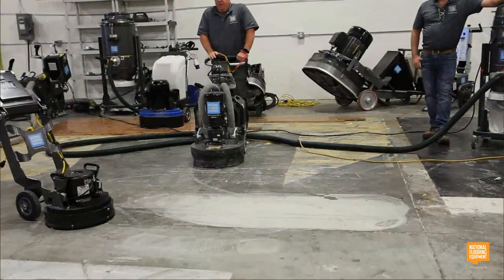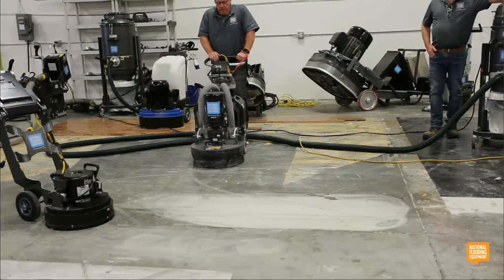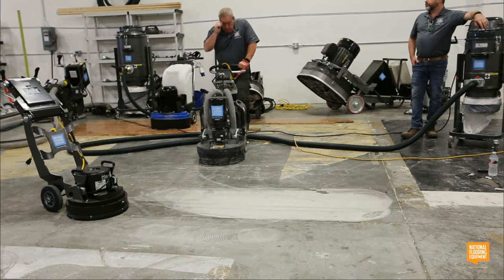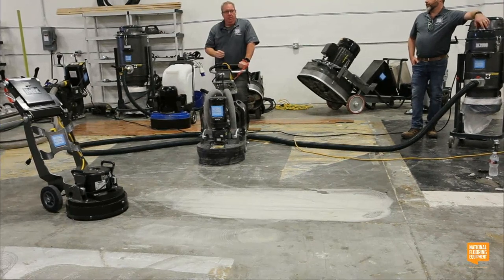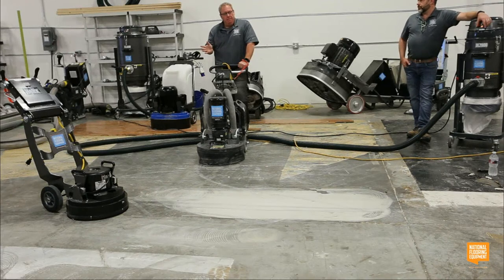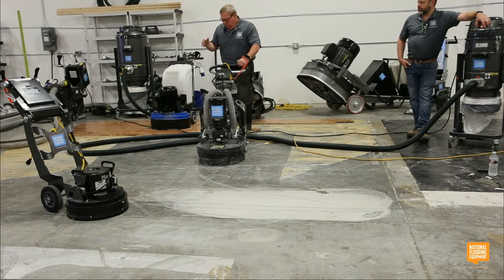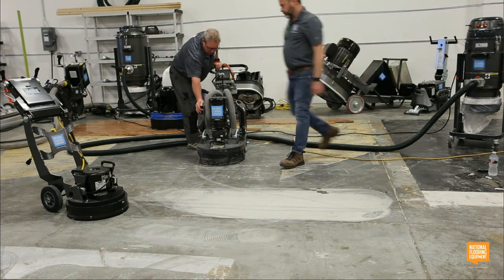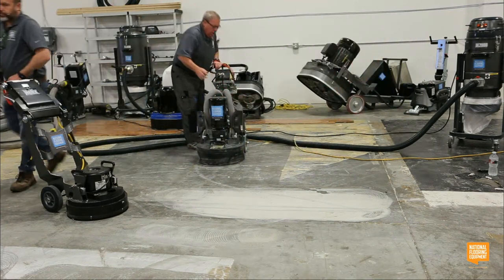This is variable speed. Typically for diamond grinding, it goes from, I can't remember off the top of my head, we have too many grinders, 400 to about 2000 RPM. My recommendation for grinding with diamond tooling for this machine, and my experience, has been about 3/4 of the way, about 1600. And I always try with one weight down on each side.